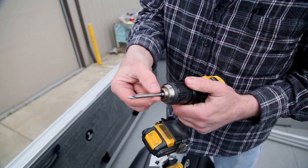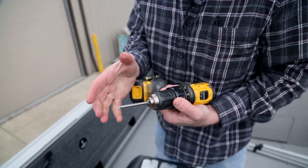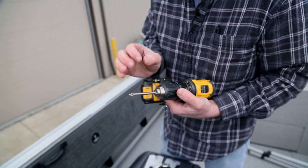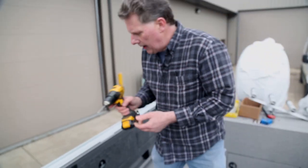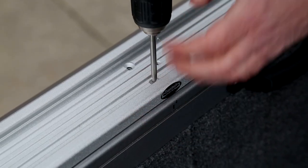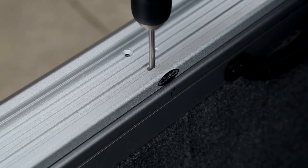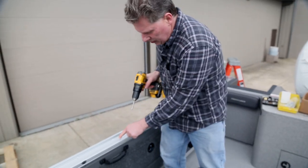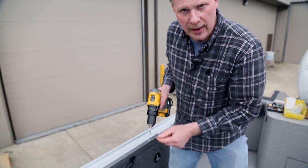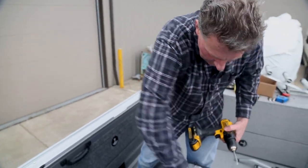The center drill is just a short, stubby solid body with a real small tip on it. If you don't have a center drill, you can use a real small diameter drill bit. I use that to go along and it actually helps guide me — I can see right down into the chamfer at the top of my hole, go down in there to give me a real good little pilot drill. With that small tip I can actually see down inside my chamfer and make sure I'm centered up right on the center of my countersunk hole in my track. That's first.